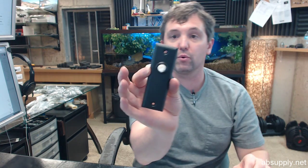That's the installation. Now what you need to be sure of is when you're installing the escutcheon hardware, of course screws are included, pre-drill those holes. I'm going to tighten that down nicely and carefully. And that's your complete installation. These are really easy to install, and they're really nice too because they are a different look rather than the regular old common storm door hardware.